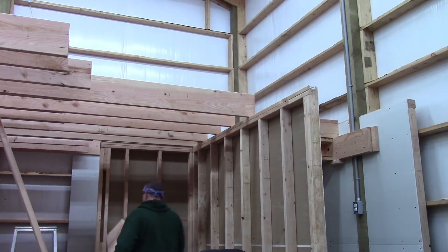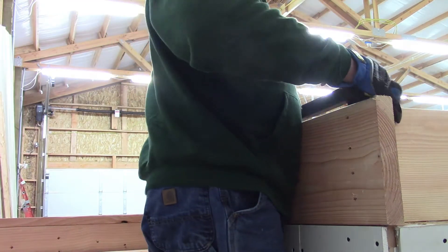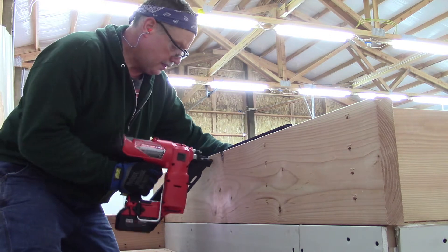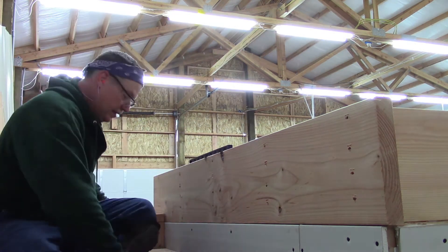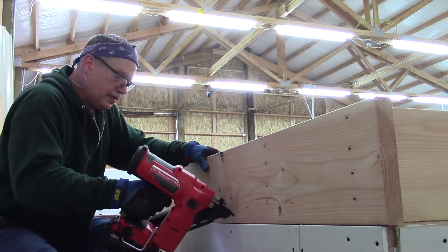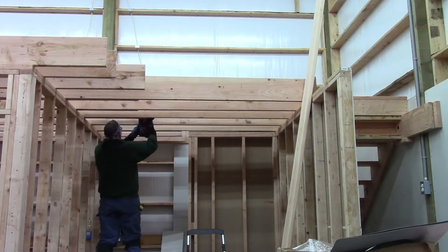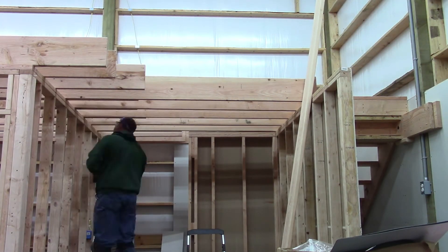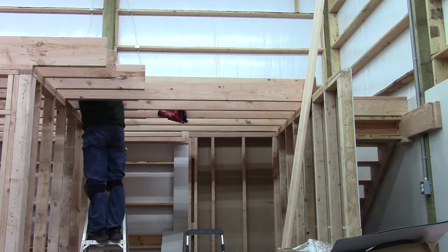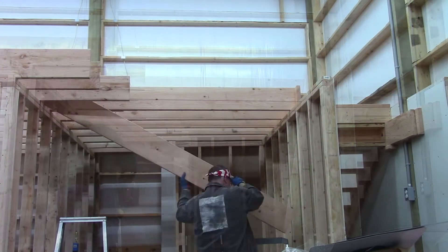Having the stairs done, the next step is to put up the rest of the floor joists. In the area of the stairwell, I'll be putting an end piece on, attaching all of the joists that fall short of that outside wall. Because of the stairs, I'll be attaching them with an end board and securing it to the top of the wall. Now that I have the end cap on the joists above the stairwell, I can position, secure, nail, and block all of the floor joists that connect to it.